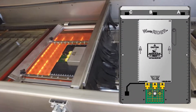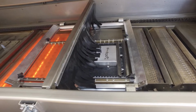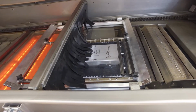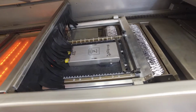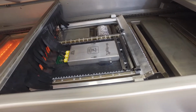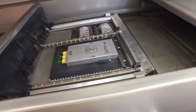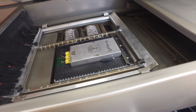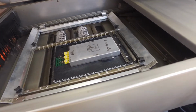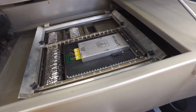Establishing the wave soldering process can be challenging, and with many soldering specialists leaving the electronics industry, the science of wave soldering is becoming a lost art, and expertise is often hard to find. The Wave Rider, used in combination with the Supermole Gold 2 profiler, creates a robust solution that measures and monitors preheat temperatures and slopes, conveyor speed, wave contact times, and parallelism.